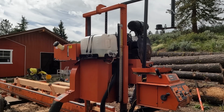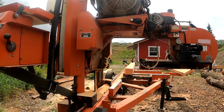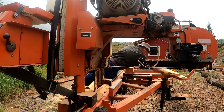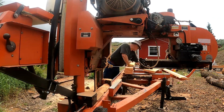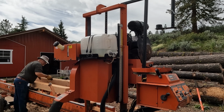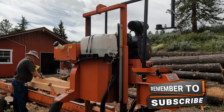All right, here we go. So this is what I was talking about. I'm down to a small enough cant that's below 5 5/8 of an inch, actually quite a bit below it. And that's okay. I can go ahead now, stack up those two flitches that I have, clamp them against the cant, which gives me a nice solid surface to clamp them to. Mill the top off so I've got all the wane off.